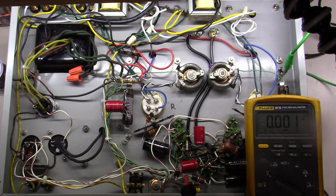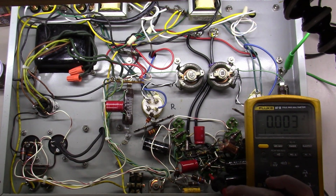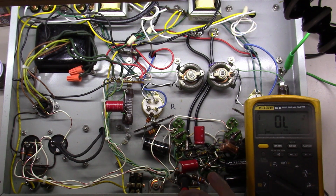The same here, I've got another 27K. And what have I got here on the other side of it? Whoops, wrong place. I'm doing this live. 87 volts on one side here, and what I have, 89 on the other. So 2 volts different on the plate of these tubes. Yes, that can make a minute difference in the output of one signal versus the other, but it's not going to make this 2x difference that we've seen here, okay?